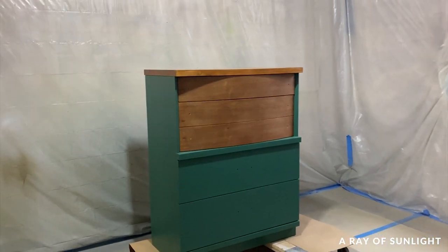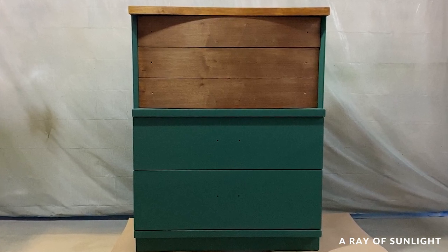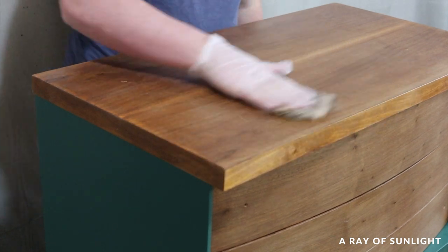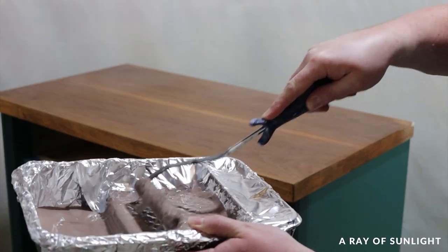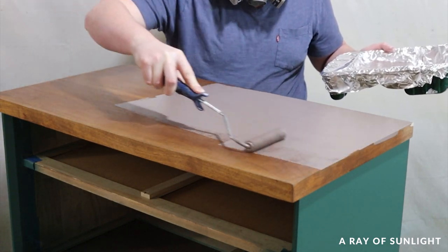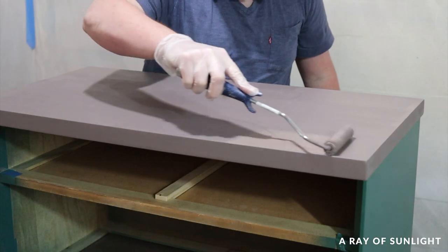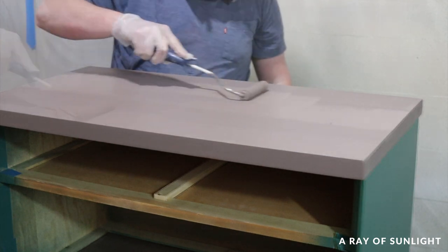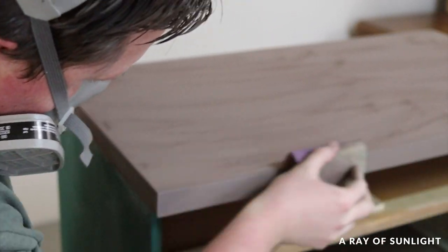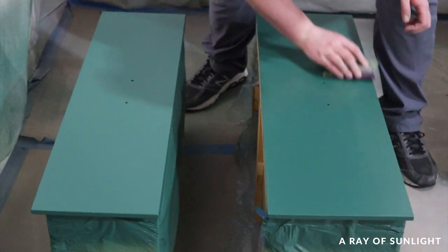Then my wife took the plastic off the top to get a good look at the whole thing, and — not to Taylor's surprise — I told him I didn't like it. The stain top and the stain drawers needed some green between them or something. I thought one of them just needed to be painted. Once she pointed it out to me, I agreed, so we went to plan B, and I primed the top of the dresser. I ended up giving it four light coats of primer. I was trying to roll it on thin so there wasn't much texture left behind, but then Natalie noticed that the wood grain wasn't filled in after two coats. So I rolled on more primer to try and fill in the deep wood grain. Then it was time to sand and sand some more. I sanded everything with 220 grit sandpaper to remove most of the texture and make it feel smoother, sanding by hand because I didn't want to sand too much.